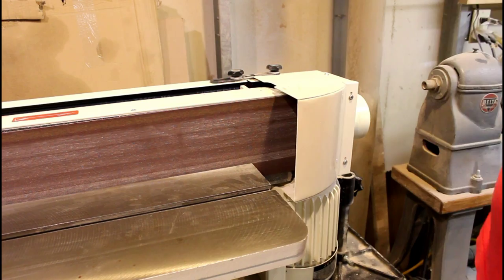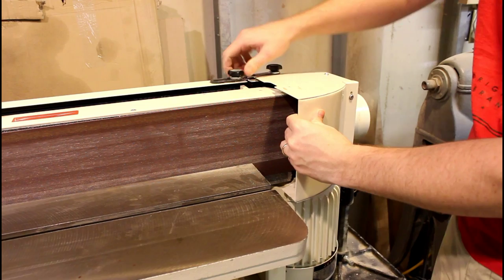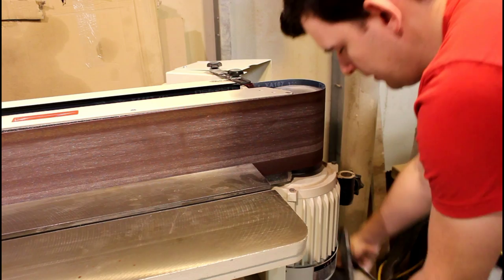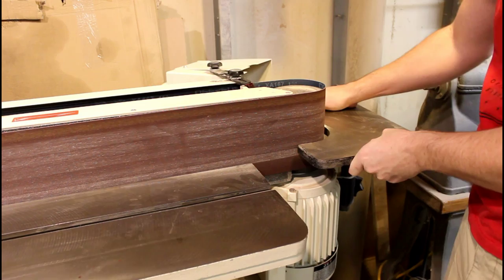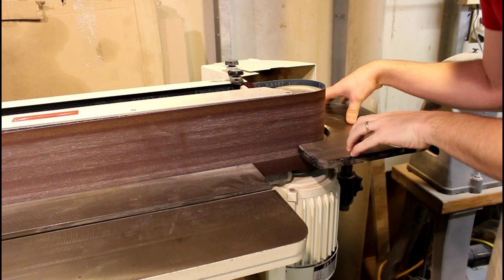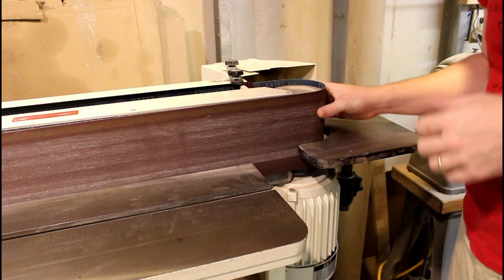In addition to the large sanding belt and the main work surface, there's also a drum on the end of this. It unscrews here — not the smoothest operation, but it works decently. The dust port opens up and the table for this spindle is stored just underneath the motor. It's very easy to get out with a single set screw; you just invert it and lock it in place with the same set screw again. This table is pretty solid — there is some play because it's only held at a single point, but most of the time it's plenty sturdy. I will say that the dust collection on this is pretty poorly designed. Having this spindle is definitely a benefit of the machine and allows you to sand inside contours very easily.